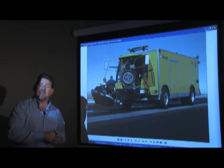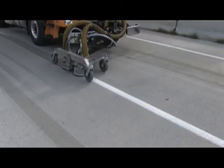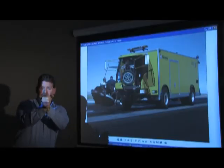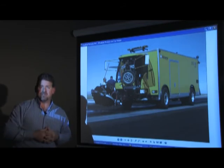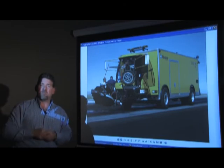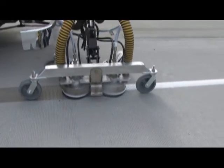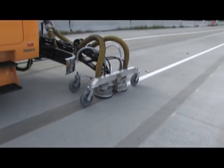How would we remove that line with a StripeHog? By positioning the heads in line, we could take one pass with 14-inch bars, then the next pass with 8-inch bars, turning slightly so that you have a total of 20 inches blasted. This allows just a margin of steering error of one inch on either side. What have you done? You have removed the marking in the quickest amount of time possible and eliminated the possibility of negatively impacting the surface on both sides of the marking.